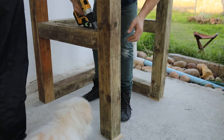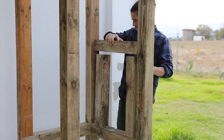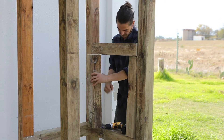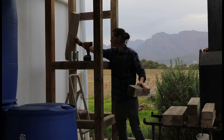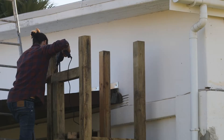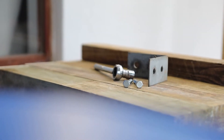Then repeat this step until all your pillars are connected. To create your second tier, screw four more 24-inch cuts of wood into your frame, 24 inches above your first tier, just like you did before. Repeat this step again to build a third tier above your second, and then one more time for a final fourth layer. Next, do a final check of your structure with a spirit level, just to ensure nothing is crooked.